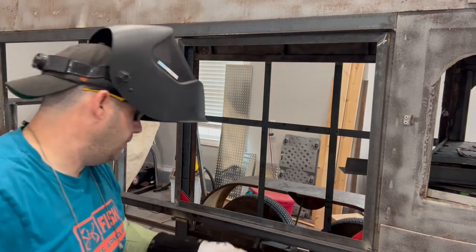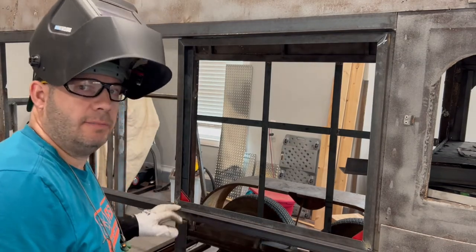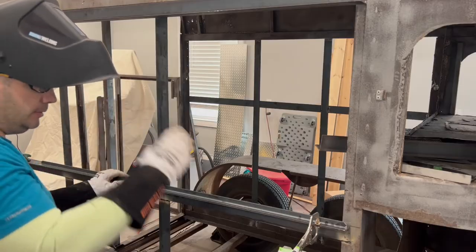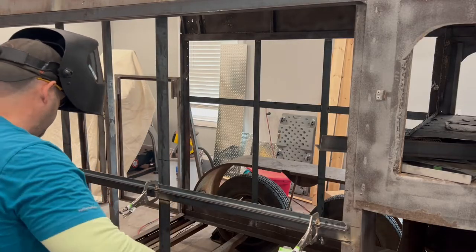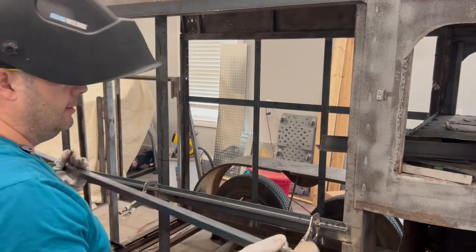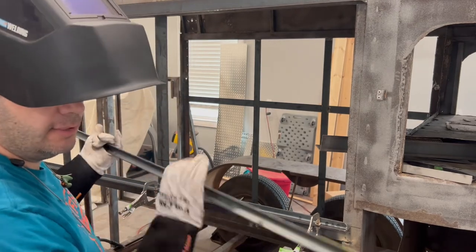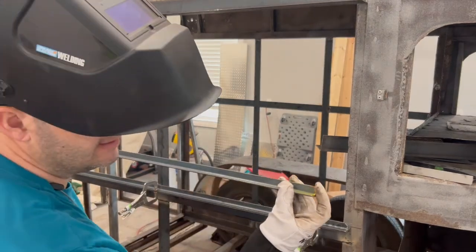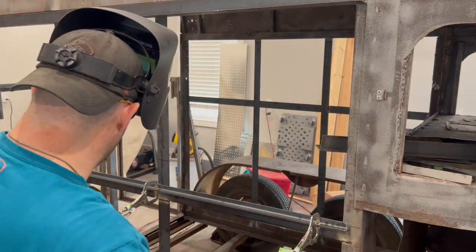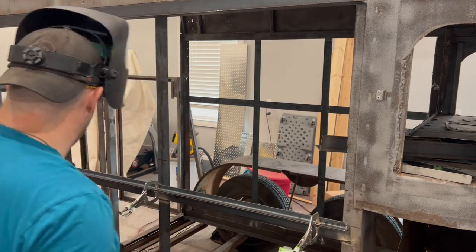And then the next thing I'm gonna do is weld on the slide guides to make my channel for my slide. So now what I'm gonna do is tack in these channel guides that I made here, tack them right onto that 2-inch angle. This is 3/4-inch angle. Something I've done is rounded these edges that are gonna be making the channel. So it just adds a nice finished look to it.